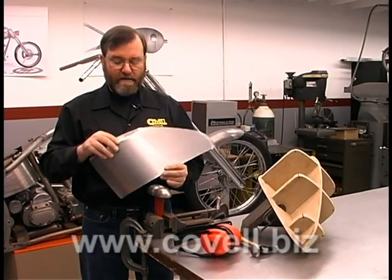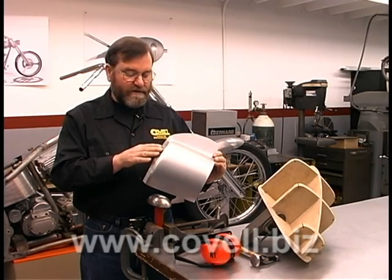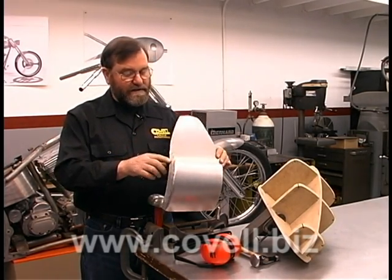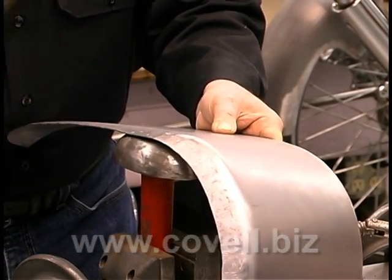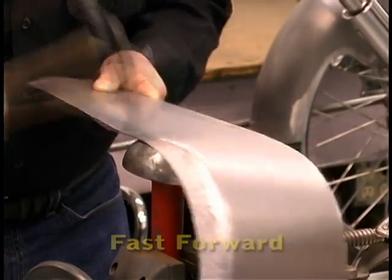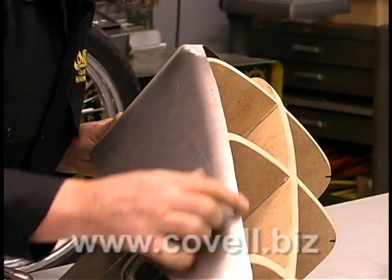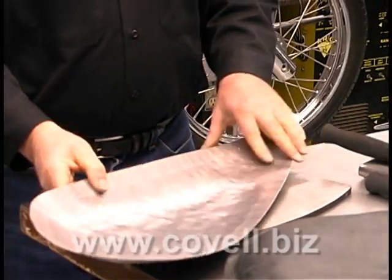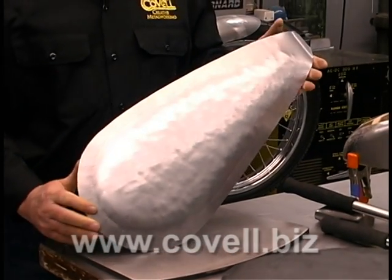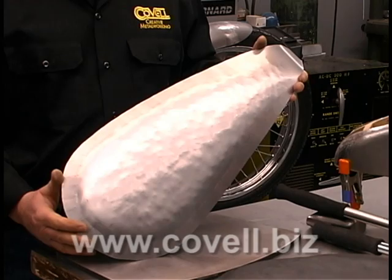What we'll do next is use a post dolly mounted in the vise to smooth the transition between the part we've formed over with the shrinker and the broad face of the gas tank side. We're also going to use the same post dolly to round over the metal that hasn't been moved yet. Now we'll try this on the buck to see how the radius I've just formed relates to the contours of the buck stations — and we're pretty darn close. The first work with the mallet and sandbag made the part look like a bag full of oranges, and now it looks something like a bag full of walnuts, so we're definitely making progress.